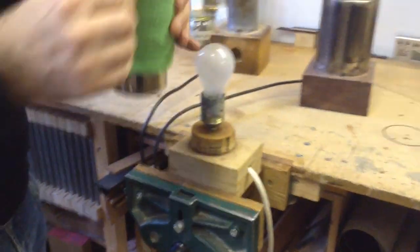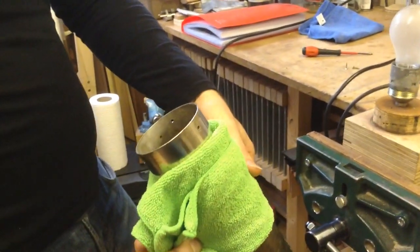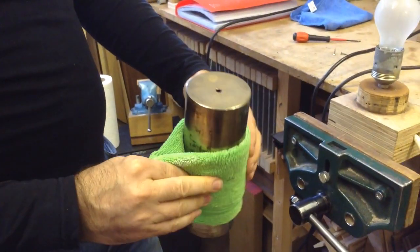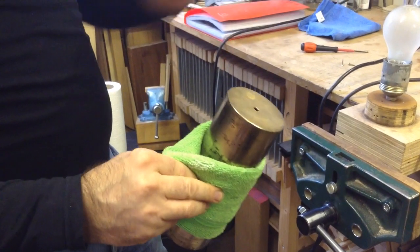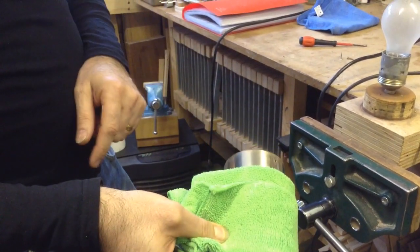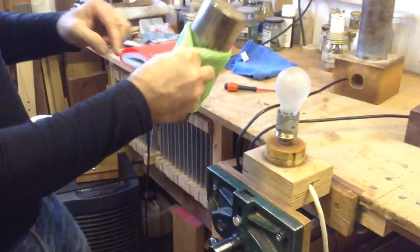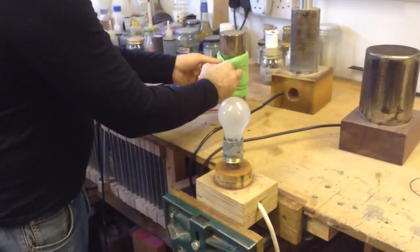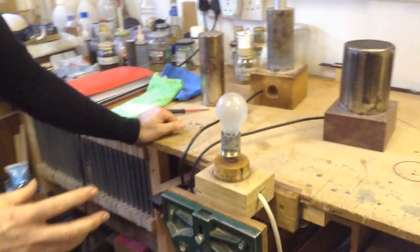You can still see the tube is a little bit hot, but basically all it is is that I went to the local metal worker and he cut me a section of tube. He welded a lid on top and then just made a few holes — three holes around the base — so that when I put it in, I can attach the metal into the base. So you can see that it's really quite a simple way of making a bending iron.